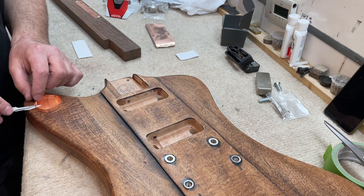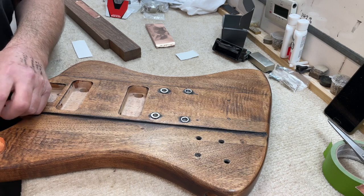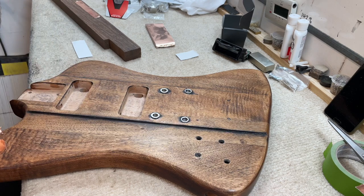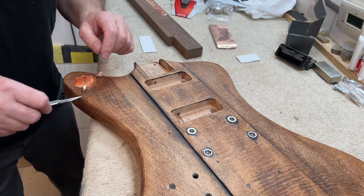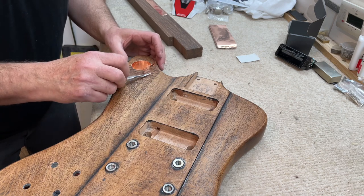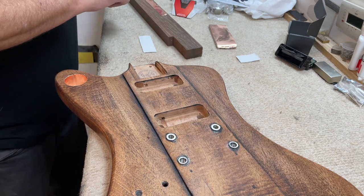What I mean by that is, if you get it right and the shielding is fully grounded, so it acts as a Faraday cage, then what it risks being is a point to short out things you don't want to short out. Especially in a little spot like here, in this bit with the switch, there's not much space, and there's a risk of the hot lugs of the switch touching against the grounded shield. That could cut off your sound altogether and you'd have no idea why it's not playing.